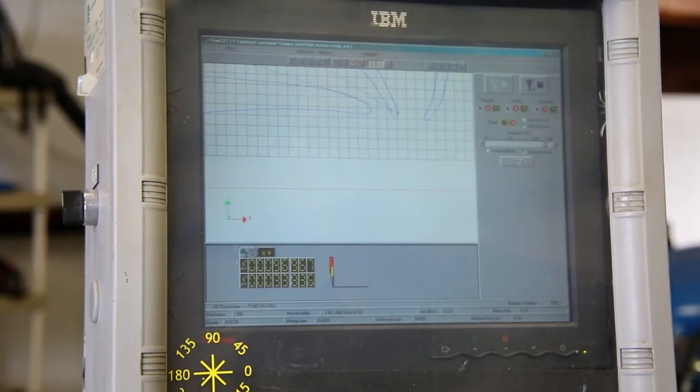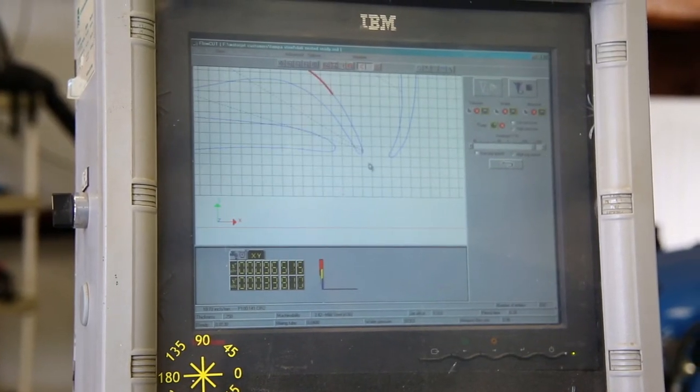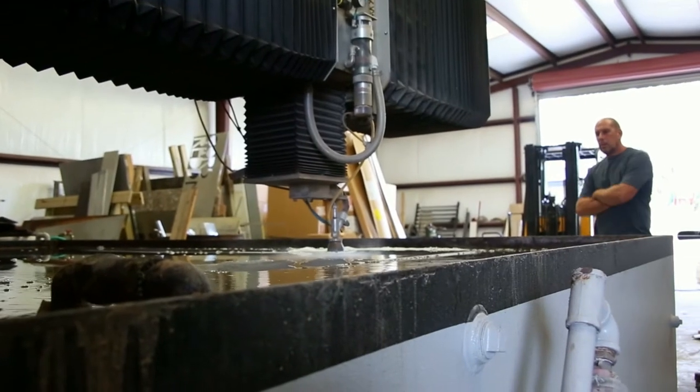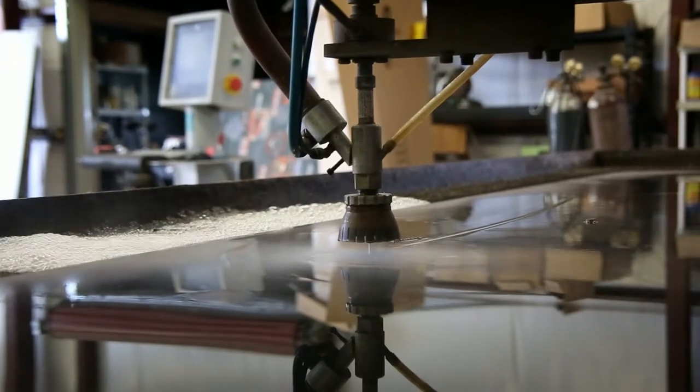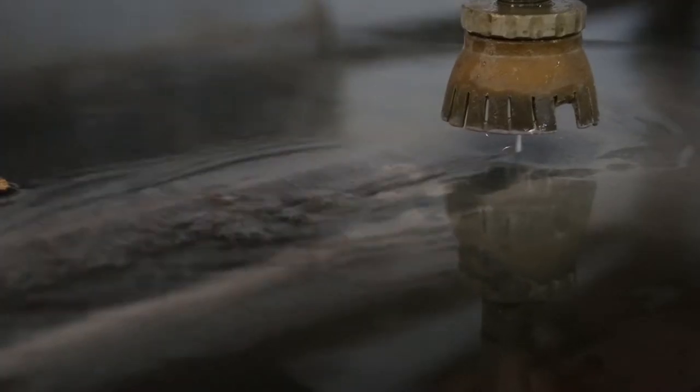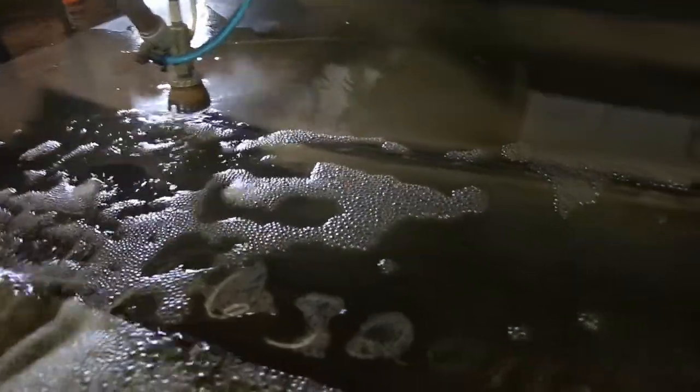Using the profiles designed for the moustache model, I designed their outlines in a CAD program. Once these elements were captured in virtual space, it was time for them to be cut out of the actual quarter-inch thick steel. This was done with the help of a high-tech process called water jet cutting. The water contains fine grains of abrasive garnet, which cleanly slice through the steel under tremendous force.